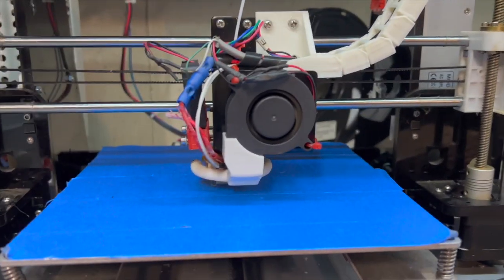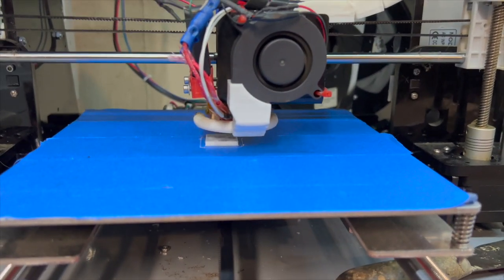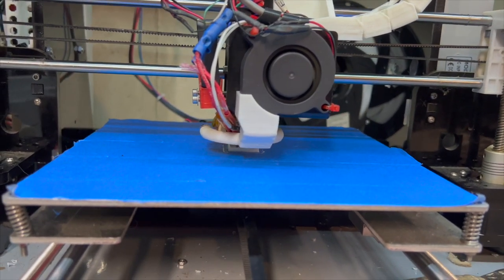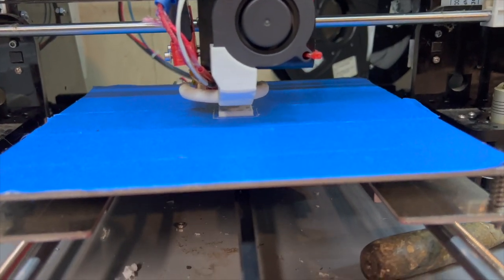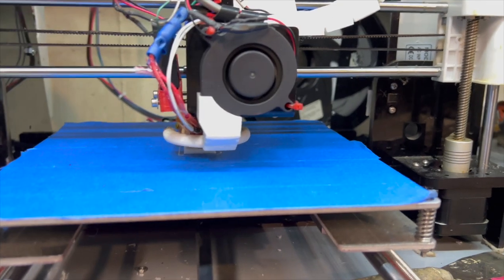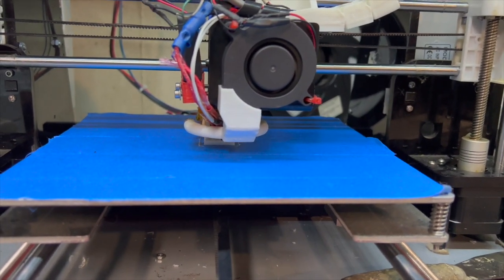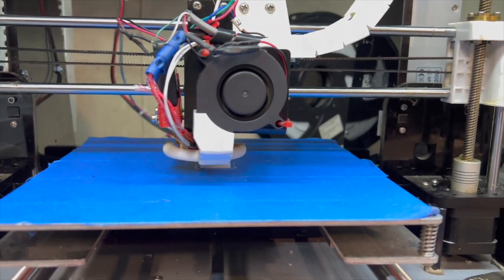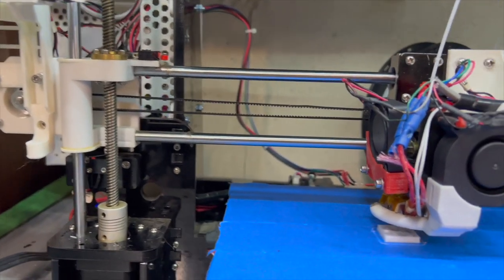It's like a recipe for a pie firmware. You can put all the ingredients in and then bake it, but once you bake it and you're eating it, you can't turn it back into ingredients. You could say, oh, I think this has this, that, and this. Like, say a pumpkin pie, obviously it would have pumpkin and whatnot, but you really can't go backwards. Once you've built the firmware, unless you have that folder that you built it from, you really can't undo a build. So once you're in the firmware.bin file, you can't really go back to unbuilt, just like that Marlin folder we had before. So, yeah, if you're doing that, I would just recommend flipping that.